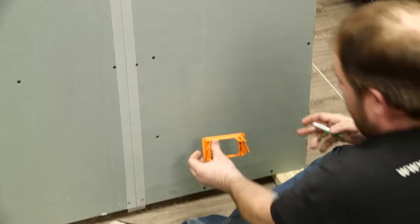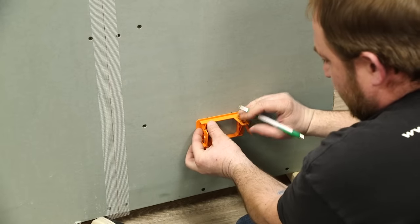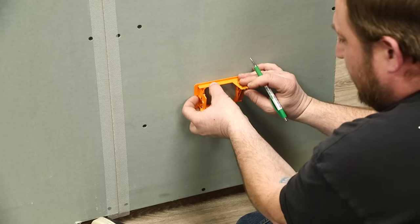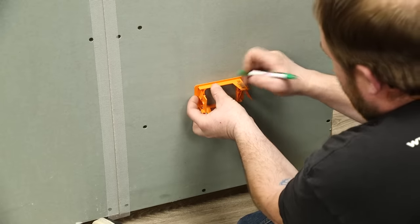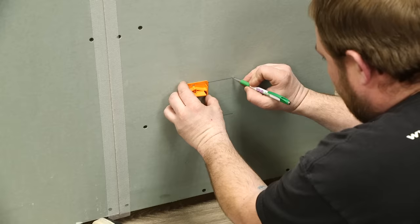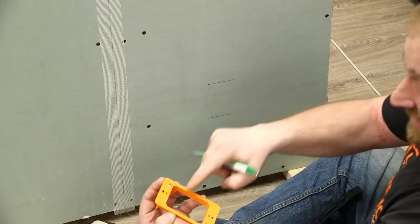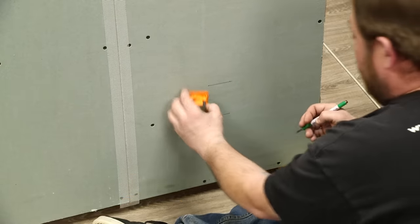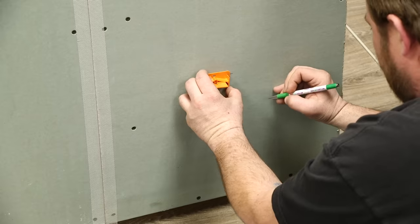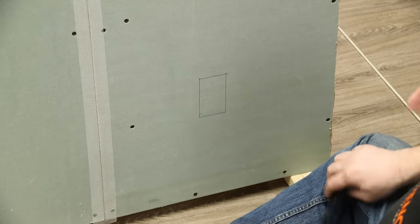This is a straight edge along the side, which is how I always prefer to do it. Take the mud ring and use it as a straight edge from dot to dot — just intersect the points and connect the dots. If you go a little past your dot it doesn't really matter, because the wall plate will cover about a quarter inch on each side of the mud ring once you put it on. Connect dot to dot and dot to dot, and now my preference is always to come in with my drill.